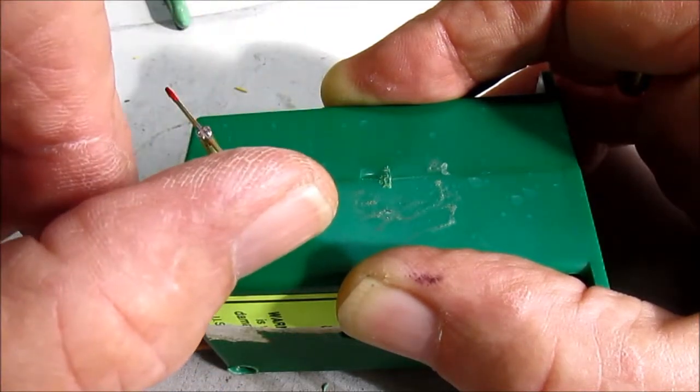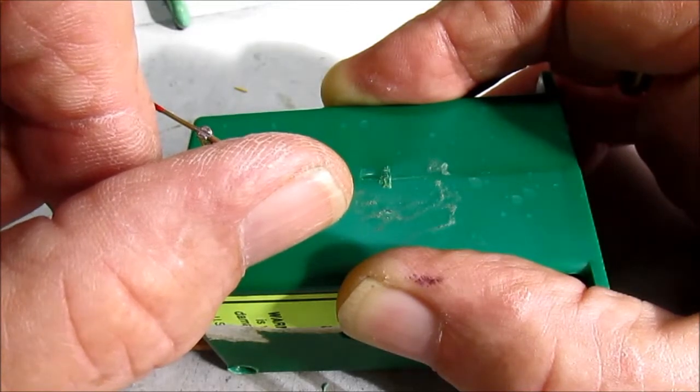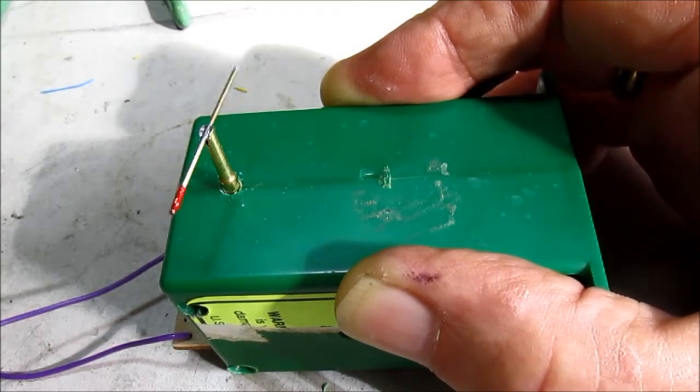And if we stall it, yeah, it could turn something quite happily. Stall current around about just under 7 milliamps. So microprocessor ports can drive these direct. I've done it before and it works quite successfully.